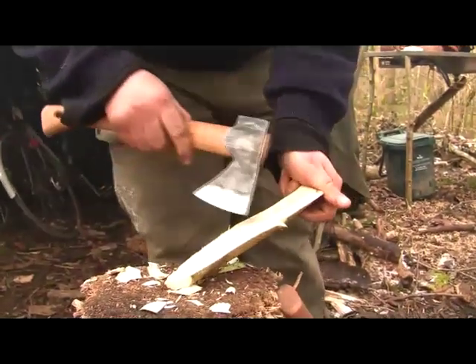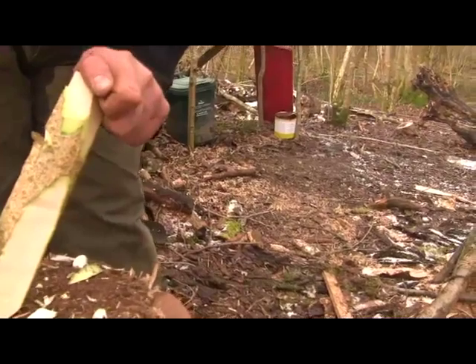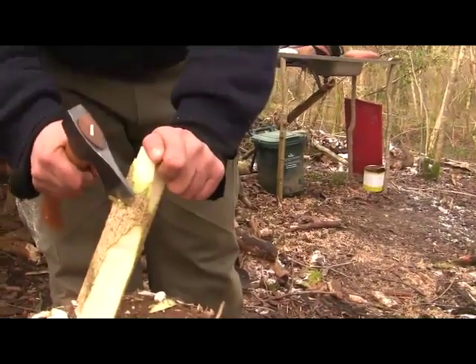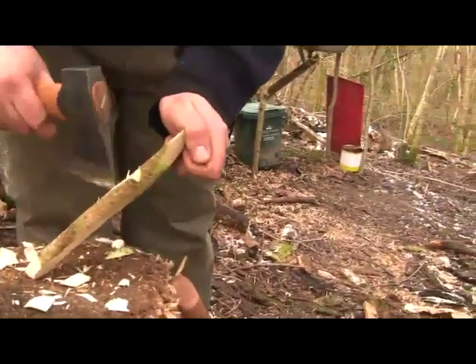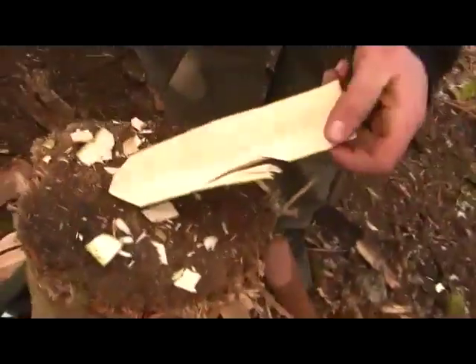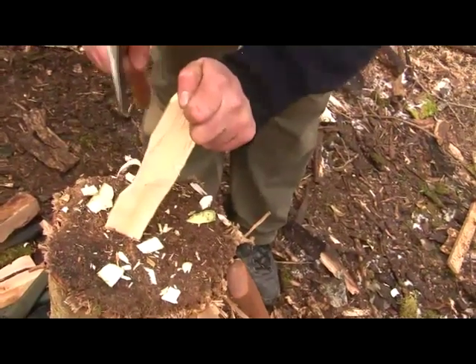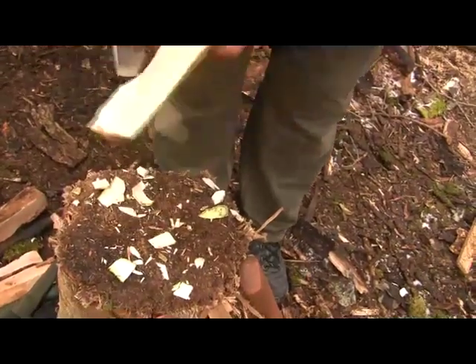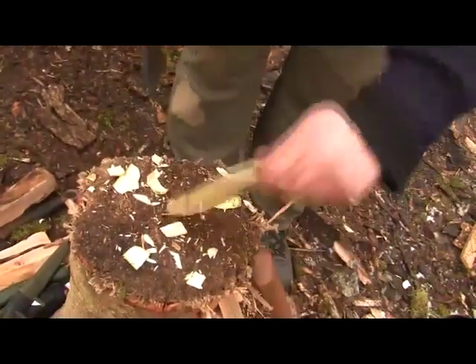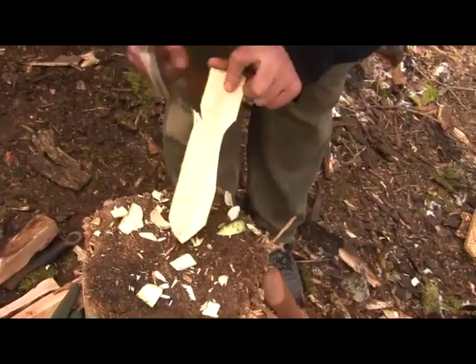Now working in to shape the bowl. You can see that's sending the splits down. The good thing about the axe is that because it's a heavy tool it will get across the fibers quite quickly, which is the difficult part using a blade. You want to do as much of that as you can with the axe. The wood wants to split along the fibers, and we try to use that to our advantage. If you want quite a fat handle at the top you've got to be careful you don't lose too much of that. We go in one way, flip it over and come back the other, and do the same on this side trying to make it even.